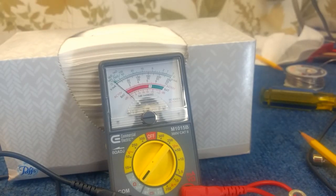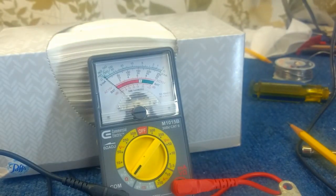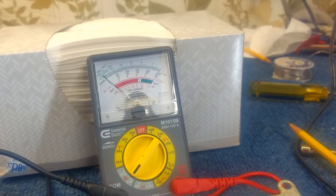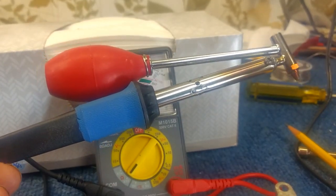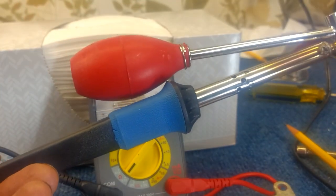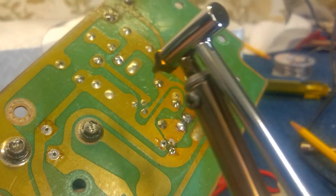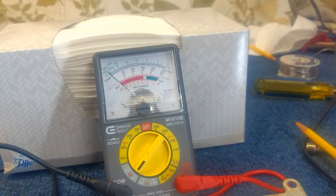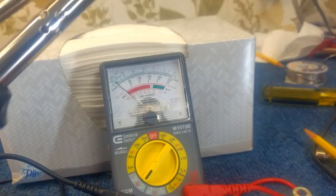Now you know how to get these components off the circuit board, and now you know how to measure them. Part two — what you saw yesterday — was putting the new components on. So remember, get yourself one of these solder sucker tools. I love these; I don't like the tube type or the mesh braid. Let them get hot — see the hole there? That goes down over the wire on the component to suck the solder off. As it's sucking, it draws air through the hole that the component wire came through to create a space between the printed circuit board and the wire.